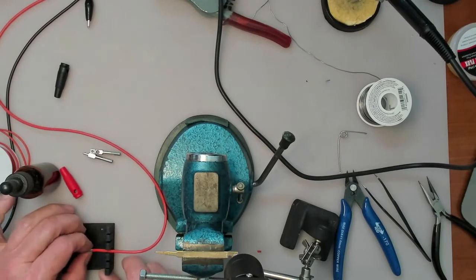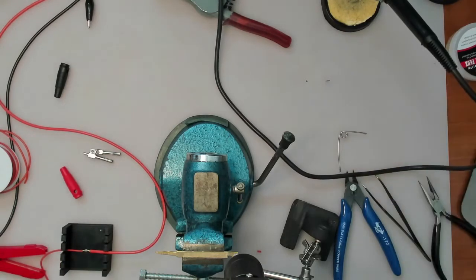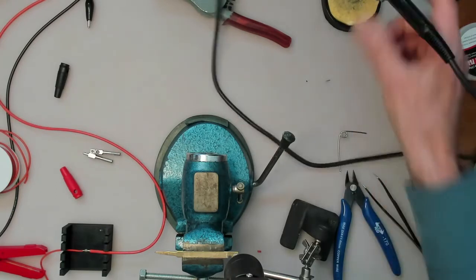So we're going to tack these two wires together. I twirled them together a bit because they're very fine wire. That actually made it easier. A little bit of flux there, that'll help. Don't forget to close the bottle of flux, because invariably I tip it over and then I get a sticky mess on my desk. It happened once. Alright, so soldering iron.